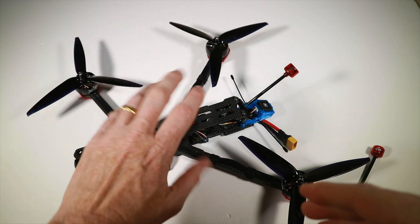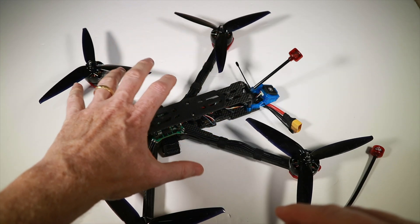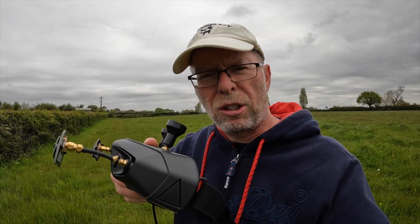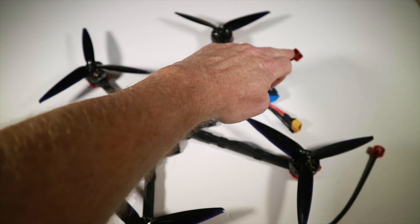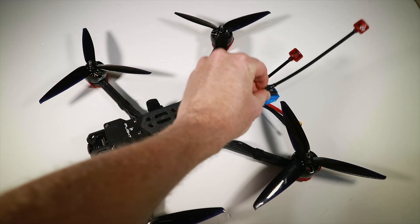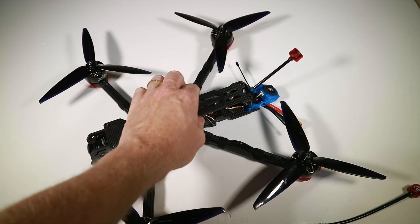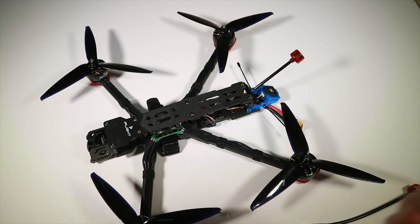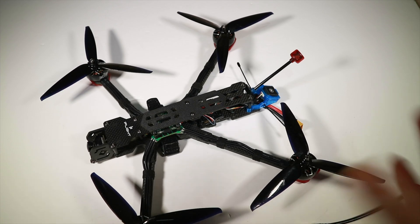Just for you guys, in case you haven't watched the previous ones: we started out with the regular Walksnail antenna and the battery on top with the regular antennas on the goggles — that was the worst situation. Perhaps the biggest upgrade was changing out the antennas on the goggles themselves — that was really quite good. We definitely got an improvement by using the UFL Rush FPV Cherry antenna over the original Walksnail antenna — that is the best setup. Thought the SMA pigtail would be better, but not. It's a shame they don't do even longer antennas. And of course, moving the battery from the top to the bottom gave less chance of blocking. A few things I've tried out and I'm really happy with this setup now. I hope if you're having any issues getting reasonable range out of Walksnail, this might help.